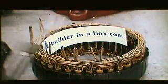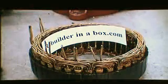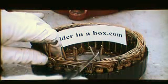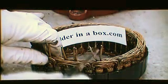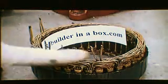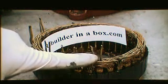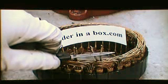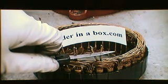All six of these leads have to be extremely clean before we can go on. If you've got double leads, separate them out and clean them independently. You can scrape them with a knife, use a wire toothbrush, a piece of sandpaper, or a buffing wheel. Each individual one has to be very, very clean — all the varnish and paint has to come completely off, all the way around. You need to see clean fresh copper for about the top three-quarters to one inch of each lead.